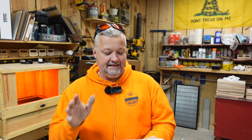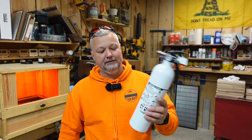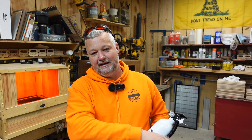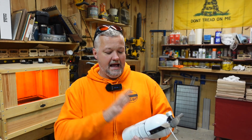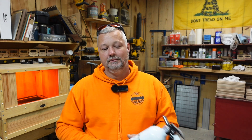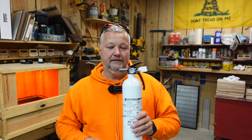The third level is a fire extinguisher. They sell two different kinds — automotive and kitchen versions. I recommend the automotive version for a laser shop because you don't have vegetable oils or grease involved. The chemical compound you want for a laser fire is more closely related to a vehicle or boat fire, since you'll have wood, electrical materials, and plastics. So I go with the automotive slash marine style fire extinguisher for my shop.